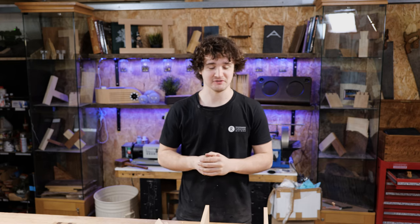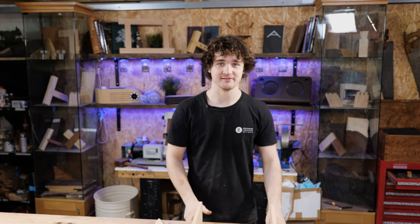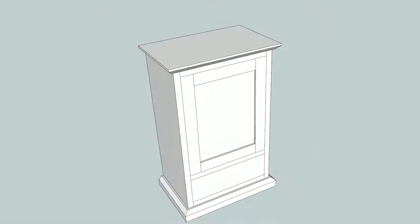Hanging a door as well as fitting a traditionally constructed drawer is not easy if the carcass is doing that. So make sure they're exactly the same size. These components are going to be nested into the side panels using lapped dovetails, as they're commonly known in the UK.